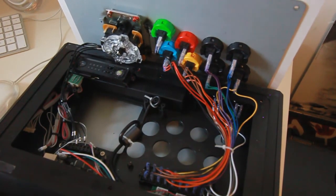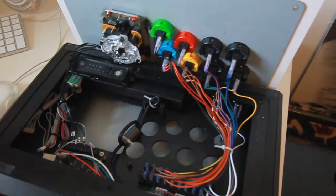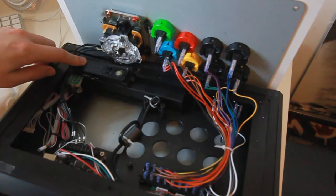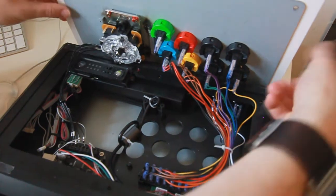Once that's done, I actually tested the wiring before doing the USB connection with the onboard jack, to make sure all the other wiring was working. As long as you put the right cables to the right terminals, everything will work fine. The turbo button needs to be held down, plug the USB into your console of choice, give it a moment to register, wiggle the stick to confirm it's working, then release the turbo button. It will then be saved in the board's memory as to which was the last console used, and you only have to do that every time a new console is to be used. Then carefully put everything back together.